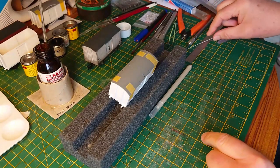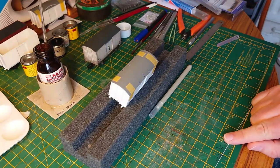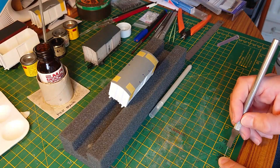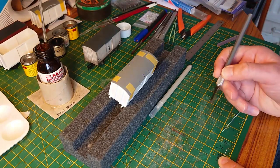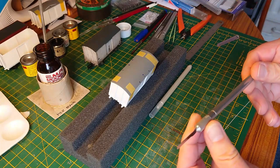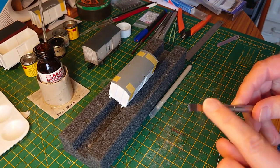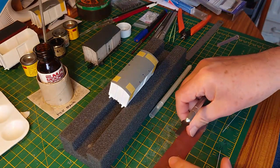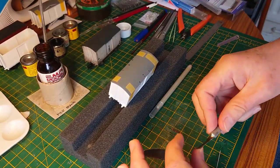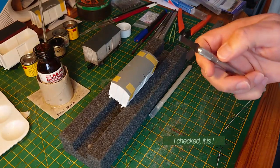So I will cut it over length. Now I know from other ones I need one and three eighths — the actual door width is about an inch, one and three eighths, which is there. I use this — a genuine original X-Acto knife from the early 1970s; they don't make them as good as this anymore — with a chisel blade. You don't need to keep buying new blades; a bit of garnet paper or emery paper to sharpen it — just go one, two, three, four, deburr that side, and that is now sharp again. This blade is probably the original one from 1971.